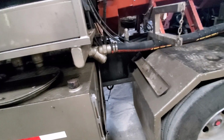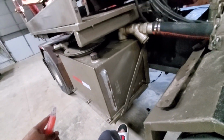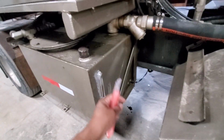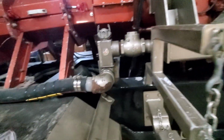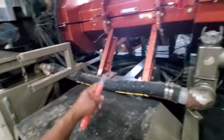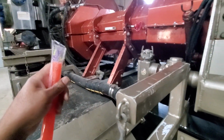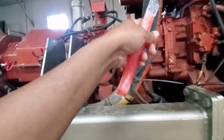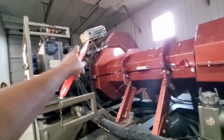This is your power end lube. Make sure this thing is full. If you see any power end leaking or you see anything leaking out of the ordinary, keep track of it. Let's see. Yeah, power end lube coming up, going to the pump. This is the feed going in, and then being supplied out, going to the other side. There's your other line coming over this way.